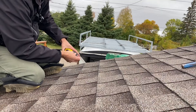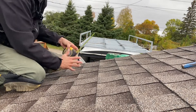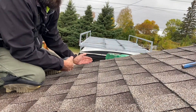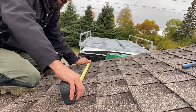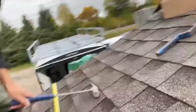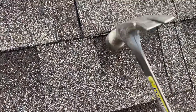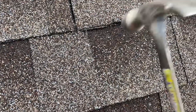From the fascia board, we had approximately an inch and a half to compensate for, because a proper roof is always overhanged by three quarters of an inch to an inch. We know we've got to come in roughly 24 inches plus an inch and a half — so that's 25 and a half inches. At 25 and a half inches, by simply using a hammer, you can find that first truss by sound and experience. You don't need to hit hard. You can hear how it goes solid, and if I move over to the right, it's hollow.